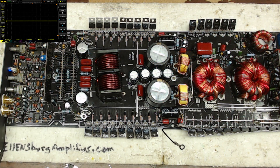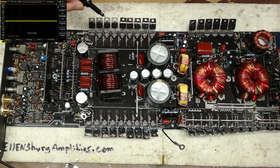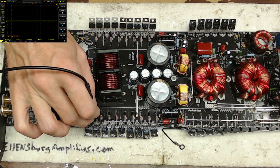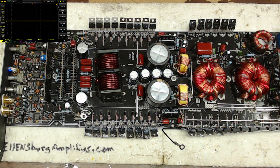Alright, I'm back with this JBL board. I've got four new 640Ns put in, and we're just going to go ahead and verify our drives here. The low-side drive — we do have our low-side drive. Let me move my trace and we will check the high-side drive — and there's our high-side drive. On both banks: low-side drive and high-side drive. So this JBL board here is complete, ready to roll once again. If you like repair content on amplifier boards — Class A, Class B, Class D, all makes and models — please stay tuned, like and subscribe. I'll be back with more. Thank you for watching, catch you on the next one.